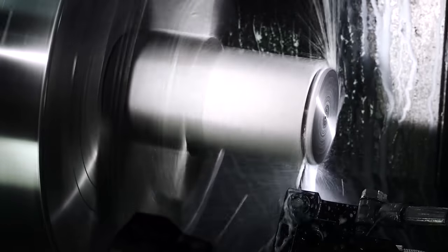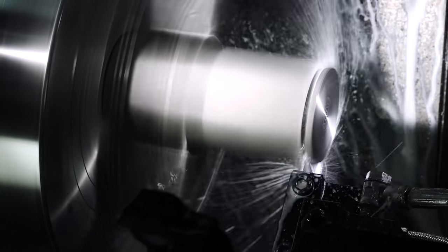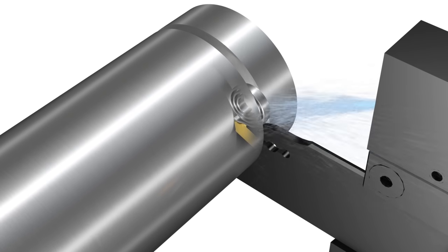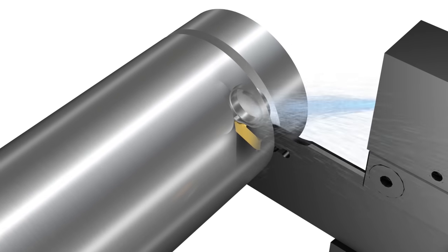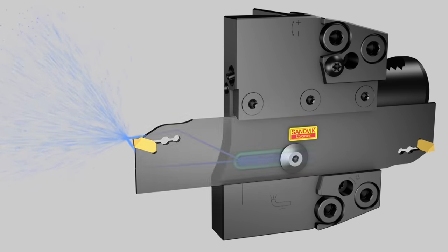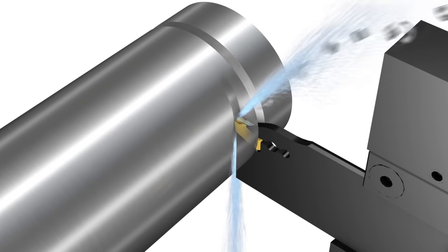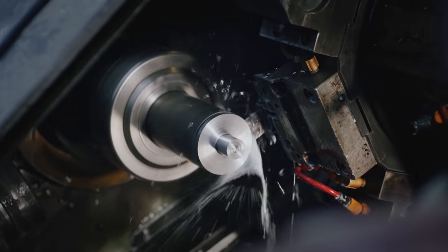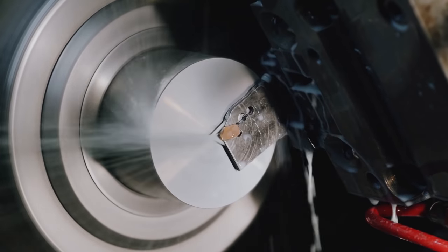There are three main stages of the parting plunge: the main long cut through the bar, the approach toward the end of the cut, and the short stage just before reaching the component's center. As the tool is fed deeper, chip evacuation becomes essential, but even if good external coolant setups are used, chips can still get in the way to cause heavy loads and poor component finish. Internal, over and under, high precision coolant channeled through the tool provides the highest machining security, with over-coolant taking care of chip control and under-coolant prolonging tool life and increasing surface speed by between 30 and 50%.